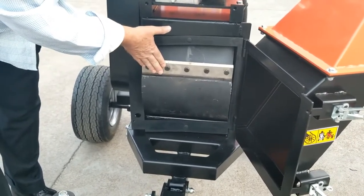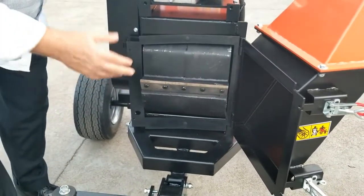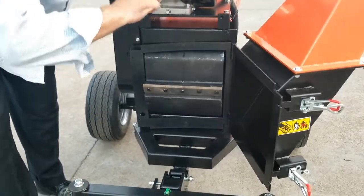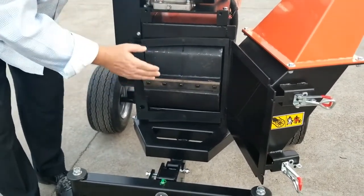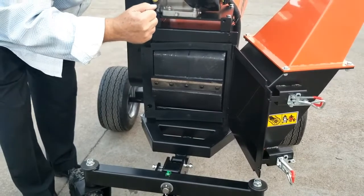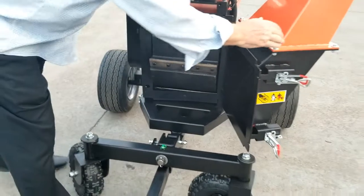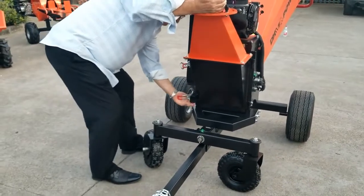This drum spins at 2400 RPM, and it's a much larger drum. It's actually got three drums inside which are cam-shaped so that it's driven with kinetic energy. So every time it comes around, right before it cuts, it has an initial burst of energy from that kinetic swing — like if you swing an axe and right before you hit that log you give it all your force for extra energy to split the log. That's what this does. We put a six-inch diameter, six-foot-long log in this and it ate the whole log in 30 seconds, and we didn't touch it. It's a gravity feed unit.